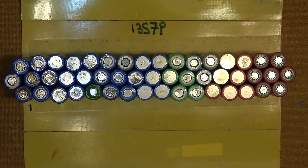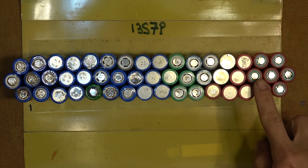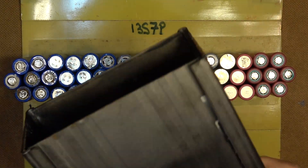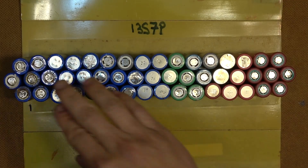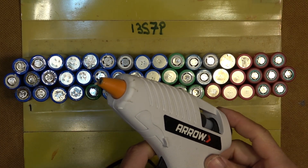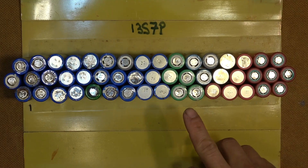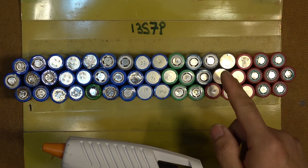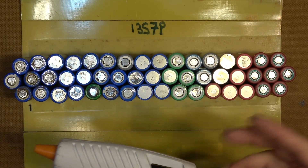It's time to put everything together. This pack is 13S7P, so I need to first put seven cells in parallel, then connect to the next seven cells in series all the way down. I have to arrange the battery pack this way because it has to fit in this case. My next step is to glue all the cells together using my hot glue gun. It's easier to put on and also easy to remove, so that when I have a bad cell I can remove it very easily.